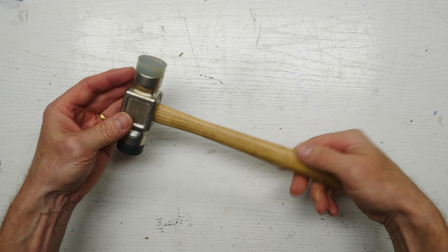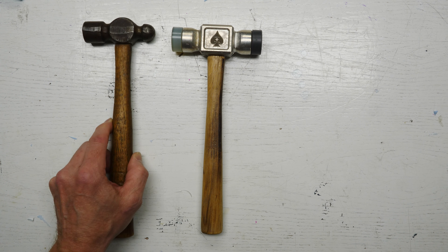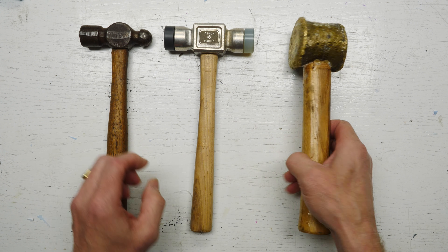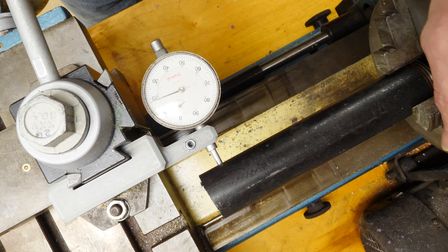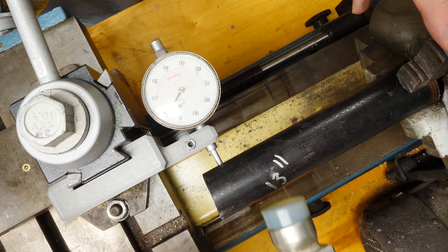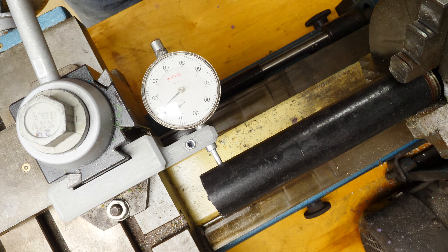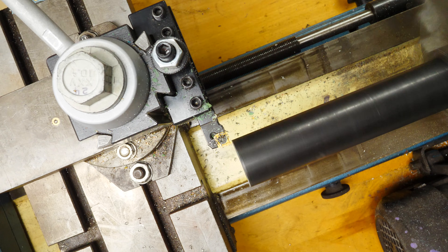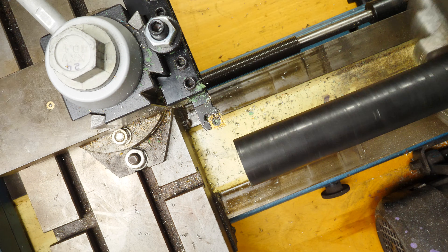All in all, the hammers come out really nice. I think the handle maybe could be a slight bit larger — tough to tell until you have it attached to the head — but really happy with how it came out. It's going to be between this ball-peen hammer and this big brass hammer in terms of weight, but of course it has plastic soft heads, so it's great as a tapping mallet for knocking things loose and aligning things. Here on the lathe we want to tap on this tube to get it centered — we've got minimal runout at this point by tapping it back and forth to get it correctly in the jaws so we can do some basic machining. In this case I'm just squaring up the ends, surfacing the rough edges cut with the hacksaw, so the material is ready to go next time.